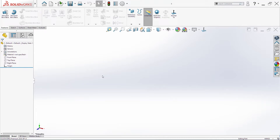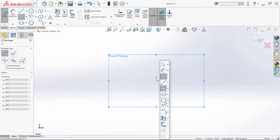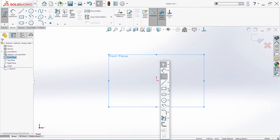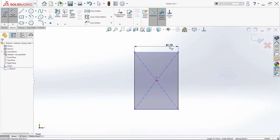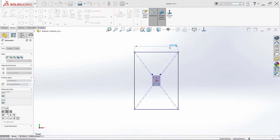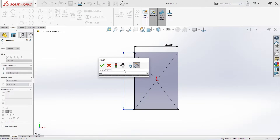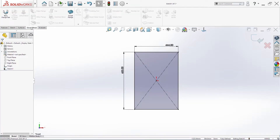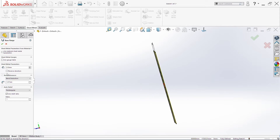Hi and welcome back. Today we are going to sketch the five parts of our electric panel. We'll start to sketch on the front plane, create one center rectangle, add a few dimensions: 4, 4, 4, 6, 5, 5. Then we'll go into sheet metal base flange with 2 millimeters thickness, bend radius 3.57 — check for the direction.